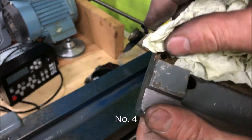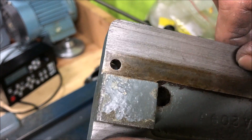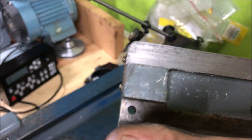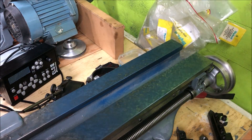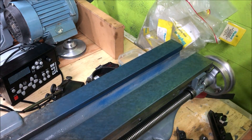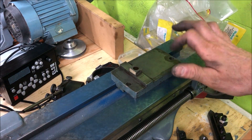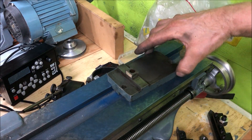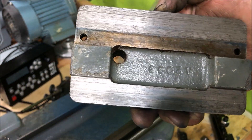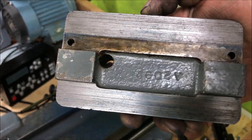So, and here you see another example — one that was taken apart. Oil under where the gib has been. Distinctive wear marks. I don't know how the bed along to this one looks, but I have my thoughts. Let's test it before scraping. Well, I don't think there is much contact here. There are some stripes, but we can improve that a lot.